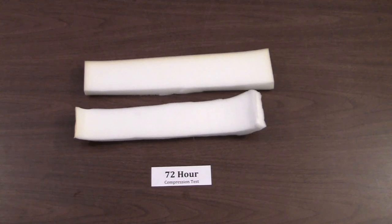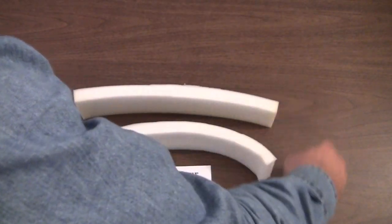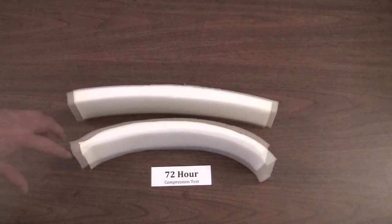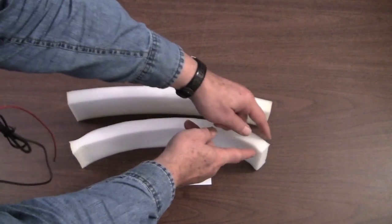It's about done with its unroll now. Turn it up and take a look — you can see the curl it has just moments after unrolling, and the thinning that has occurred at the really high pressure points. The very high pressure points are at the very beginning of the roll, down on the inside where we start rolling it, and at the very end where it gets a little extra fold and compression.